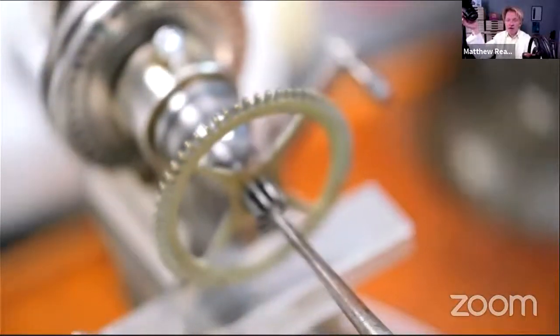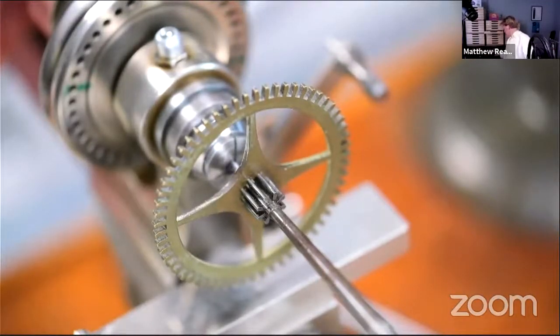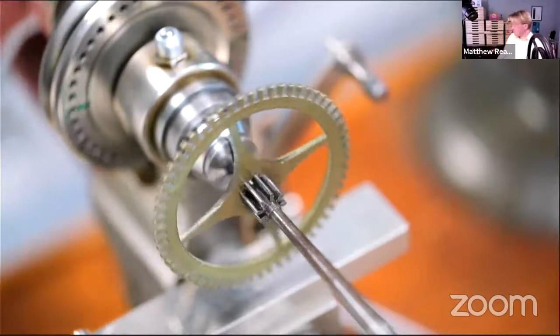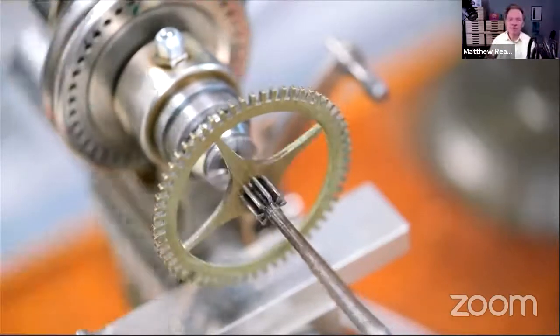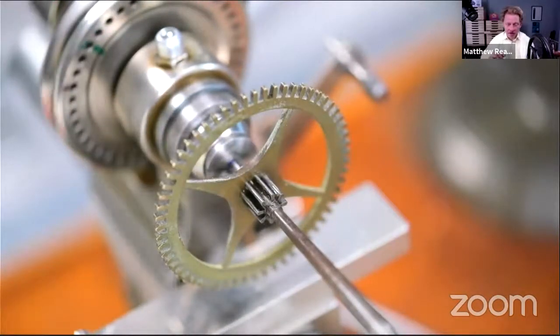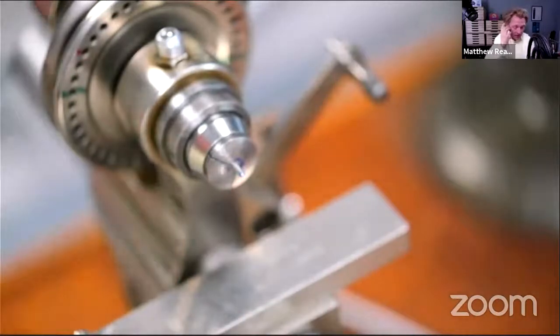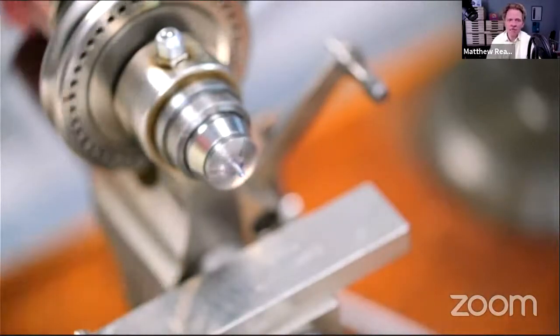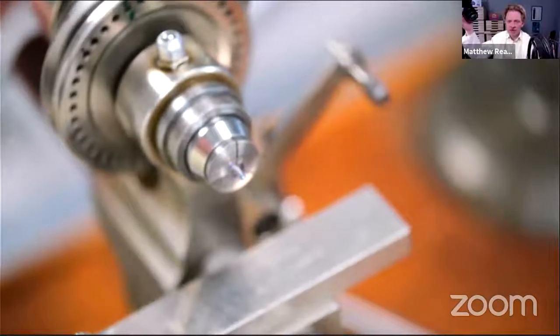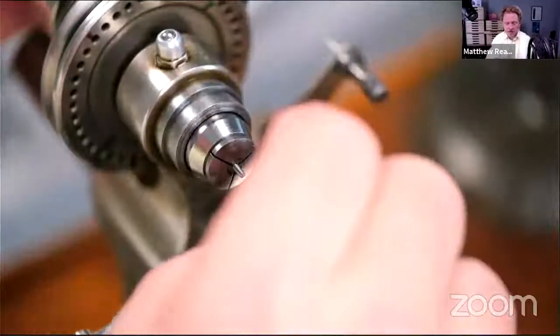If you want it to come apart again, then I use the medium strength one. It'll still be in the tool bag. I use the same version, but medium strength. Never really use the low strength stuff. I've always found you can get the medium strength stuff apart quite easily, with a little bit of heat on it as well. But let's see if we can do it as it is without any adhesive on it.